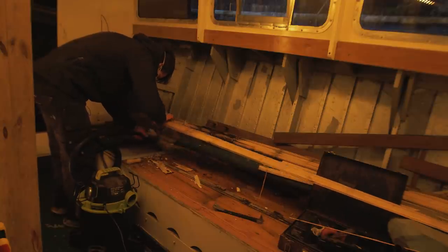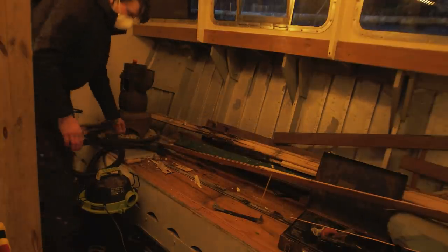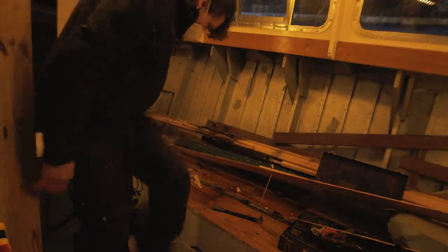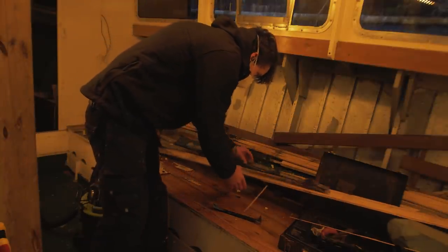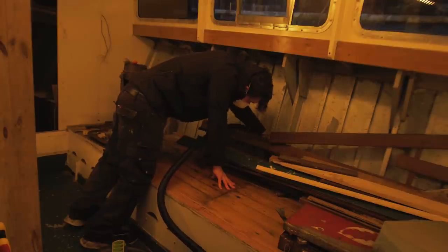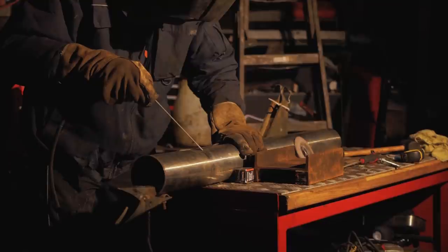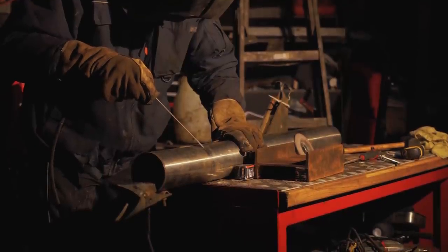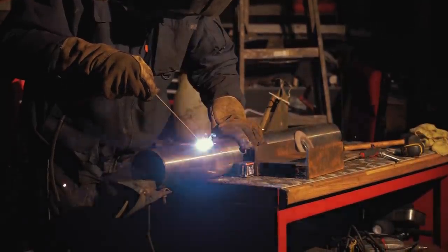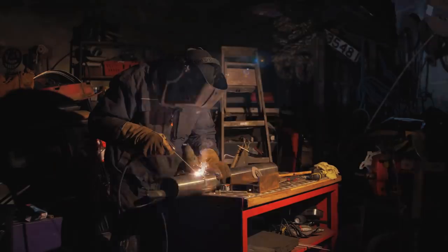We did cut the hole bigger. We measured it so that we would weld the steel plate on in place, so that as we lower down the chimney, it would fit in securely and then pop straight onto that cap or that angle on the actual cast iron stove, the old CIE stove. And that worked out perfectly. We got our measurements done, we made sure our measurements were done accurately. I think we even measured more than twice, just to make sure it was 100%.